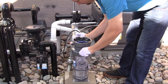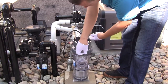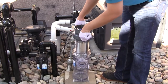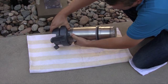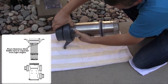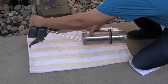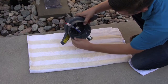Grasp the two large handles on the vessel lock nut and fully unscrew the light engine counter-clockwise. Using the handles on the vessel lock nut, lift the light engine straight up and out of the vessel. There is a stainless steel sleeve that surrounds the quartz sleeve, which must be removed. To remove the sleeve, pinch the end in three places while pulling it away from the light engine. Pinching the sleeve at those points will flex the surface enough to unhook itself from the light engine. The quartz sleeve will now be exposed and can be cleaned.